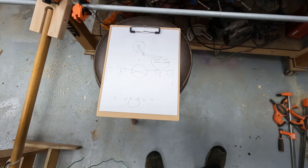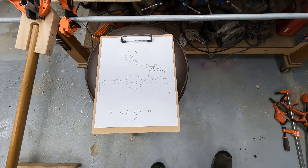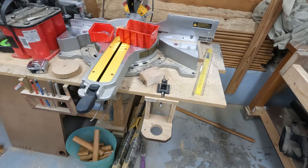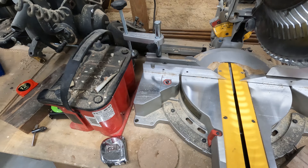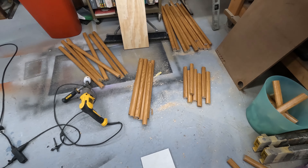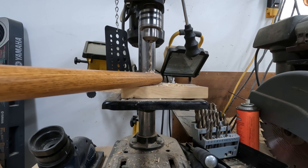The thing I don't know yet is the gear ratio — like how big the wheel on the ground has to be. I might make the wheel from scratch. I'm gonna need a particular size wheel for the cycle to be a certain distance, depending on how big these legs are. It won't be a big wheel, I'm thinking. The thinking has been getting so deep I just want to do some busy work, so I set up my stop and cut out all the leg segments. I'm gonna end-drill all of them except for the very tip that touches the ground. I labeled them all A, B, C, D, and X for the co-ax up. Just eyeballing about an inch from the edge in the center.